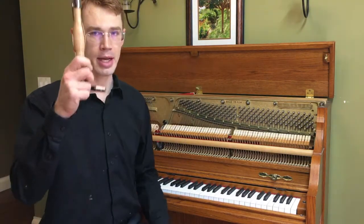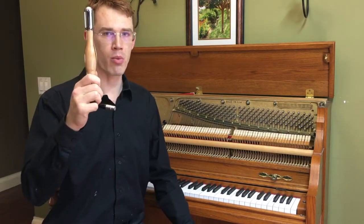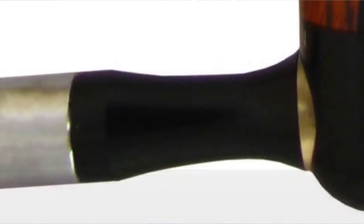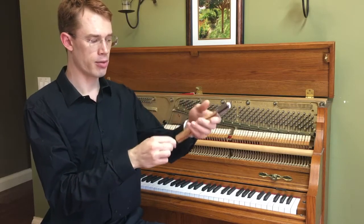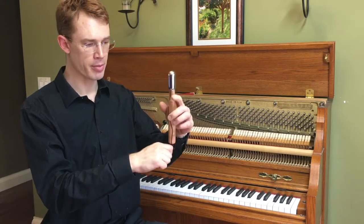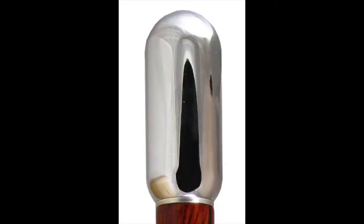The impact tamping. This is what you're watching the video to see. The impact hammer is three basic parts. This is where the magic comes from, the cam. Now this rotates about 45 degrees, and it rotates freely, and then it ends its travel. It ends it abruptly, and it transfers any energy that's been multiplied by the handle from the weight.